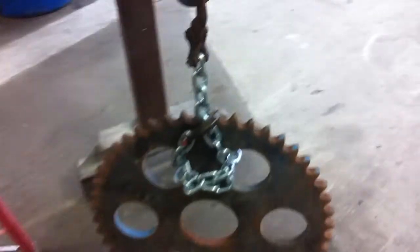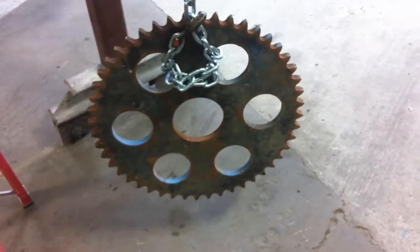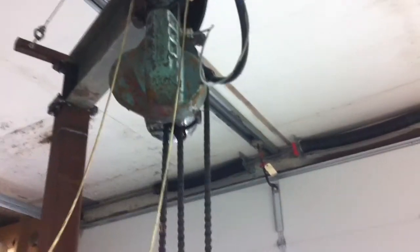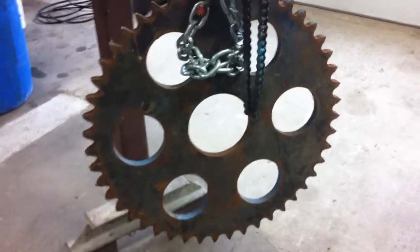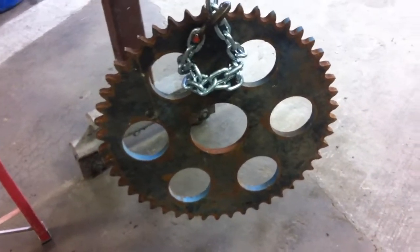So I've got a load on it. I'll just put the cover back on here and run it up and down a little bit. I think I have the acceleration set to about five or six seconds right now, so we'll take it up and back down. And since we're placing parts, I have no deceleration — just a coast to stop. That way it stops wherever you let go of the switch.